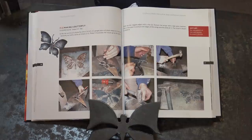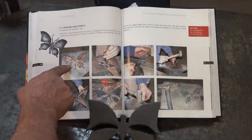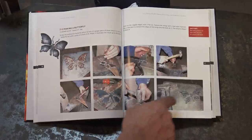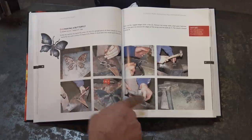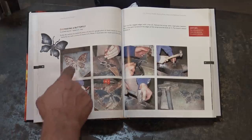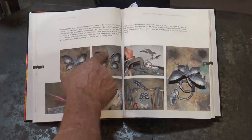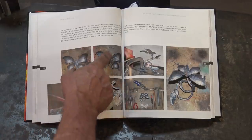Here's the project on page 96 of the book. The butterfly it shows here is a little bit different than the butterfly it shows in this picture, so we have some options on how we want to proceed. What they're showing next is texturing with a ball peen hammer and putting some additional texture in the edges with a cross peen hammer. This one actually looks like it was stamped with an eye punch or a rivet setter, and we may do a little bit of both of those techniques. The whole thing is dished and the body is shaped, and at some point they've added on some wings which are gas welded in place. That's probably the approach we'll take — it seems like the most straightforward.